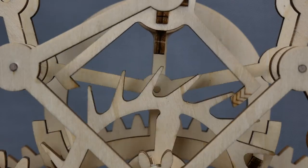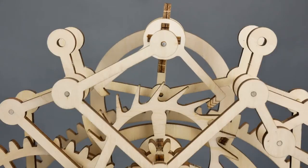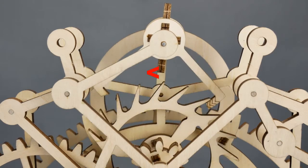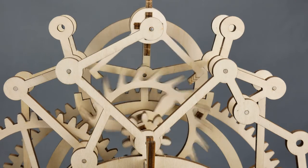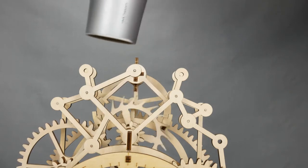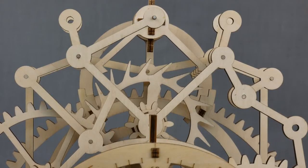The first thing we have to do is get the clock in beat — that means the ticks and the tocks need to be equal. There's no adjustment available on the clock, so we're going to be doing this by sticking things underneath the feet. Watch the pendulum and listen out for the tick that takes the longest — that's the side you need to shim up. Just tear up some cardboard and stick it under the feet until you've got a nice even beat going. My clock would run for about 30 seconds and then stop, so I hit the escape wheel with a hairdryer to soften up the wax and help it spread more evenly over the teeth. I added a bit more wax in places that needed it, and within half an hour I had the clock running — for about half an hour at a time, then it would stop. However, after a week of being wound up every day, the clock found its stride and will happily tick along for five to six hours at a time.